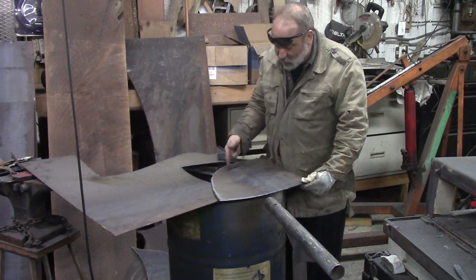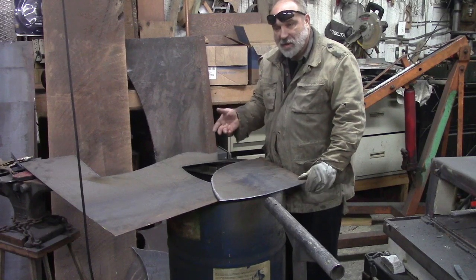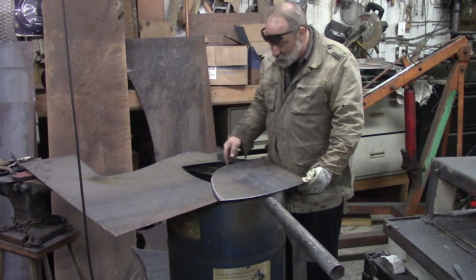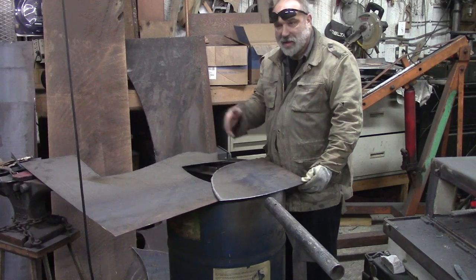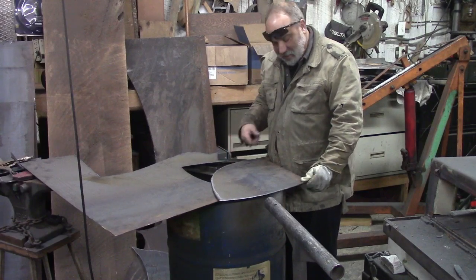I like that I can touch the metal with the torch. With a propane torch or oxy-fuel, either propane or acetylene, if you touch your puddle, of course, it blocks the tip up, and you're stuck there another 20 minutes cleaning the tip. This one has a drag tip that it's meant to touch, so I like that.